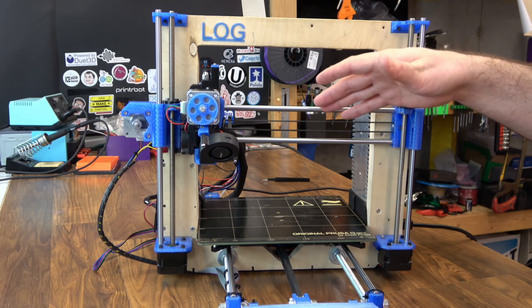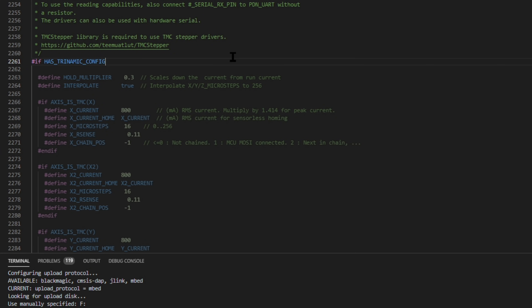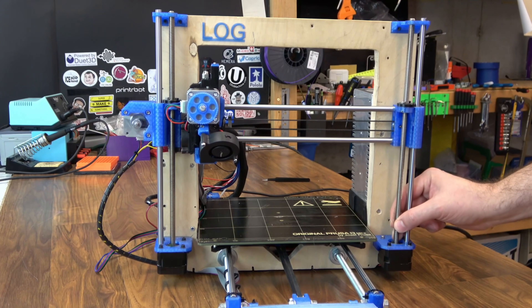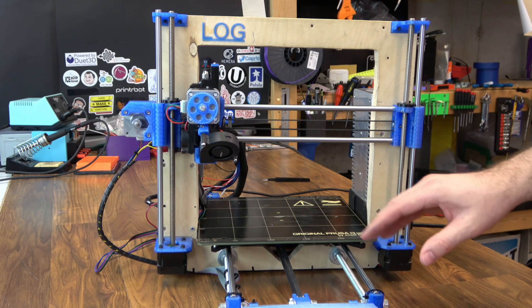These machines also have motor current timeout, so your motors don't stay energized all the time. When that happens you could still lose a couple of steps because you can back-feed these lead screws. In configuration_adv.h in Marlin, under idle stepper shutdown, the default deactivate time is 120 seconds. To keep it from falling in Z, you can set this to false. If you have a smart driver, this idle current can be brought down quite a bit — in the has_trinamic configuration, I set the hold multiplier to 0.3, so it holds at 30% of the normal current. My Z current is set to 800. After that setting is enabled and after you've moved your Z once after first boot, you will never lose that holding current.